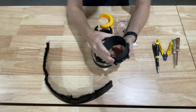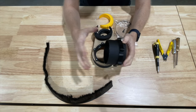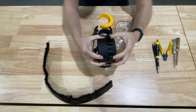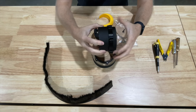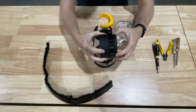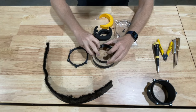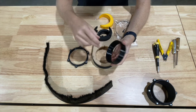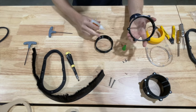This fits onto a four-inch hose going to a dust collector. We do have a two-and-a-half inch size if you need that. You're going to take one of the mag rings, glue it right into place — just put some glue right along the interior edge here. Slip it on, clean up any glue that might be on the outer ring, and set that aside to let it dry. We're going to do the same thing to this little ring here — it sits down into the acrylic and is held on by three screws, but first let's put our mag ring on.